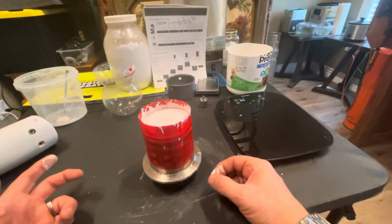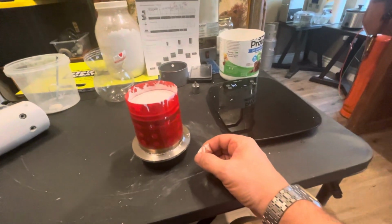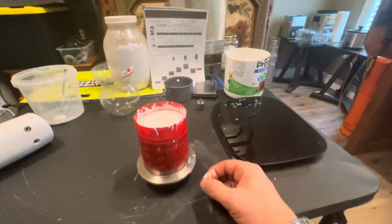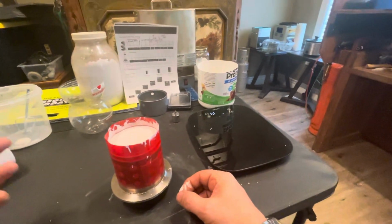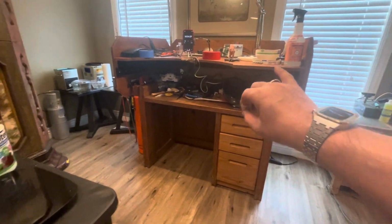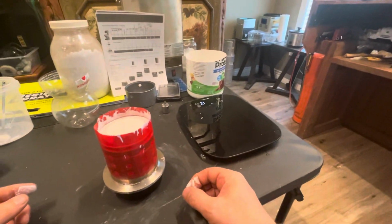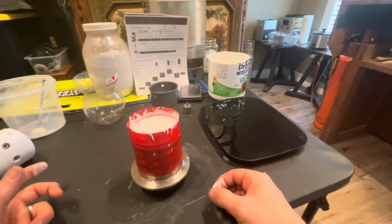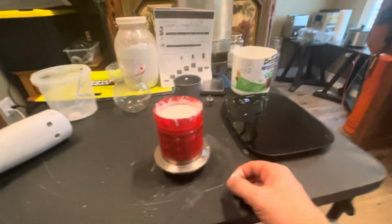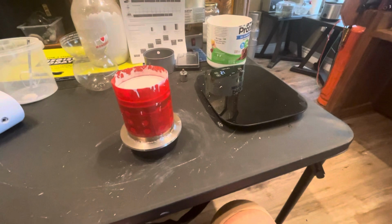But like I said, if you didn't have a vacuum machine and all this fanciness to prevent bubbles from sticking to your work, even with this vacuum, even with everything, if you don't put debubblizer on your mold, the thing will still have these micro tiny bubbles that'll mess with your mold. Wow, this really isn't setting.